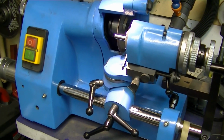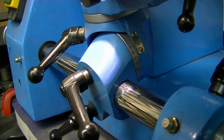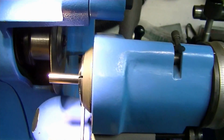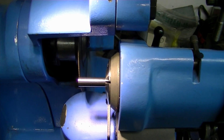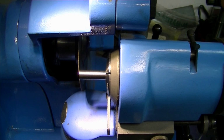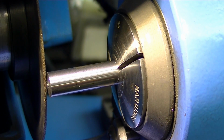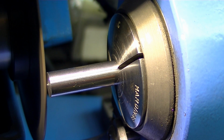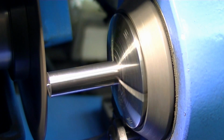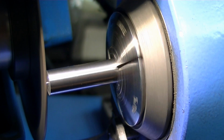Now we're going to use the D-bit grinder to slice off some pieces of this 5/16 diameter ultra micrograin carbide. One real important thing is to have the angle here set at 0 so we get a square cut, and be at 90 degrees here on the stop, and then we just have to feed in. I'm going to touch off with this. I have my dials zeroed on my main slide, and I'm going to come in and bring this into here. I'm going to come in and touch with the wheel using the feed of the actual spindle feed on this. So I'm going to turn on here, loosen my spindle lock, come in and just touch where I can tell that I'm touching on here. There we go. Lock my spindle. While I'm here, I'm going to get rid of the little tit on the end there.